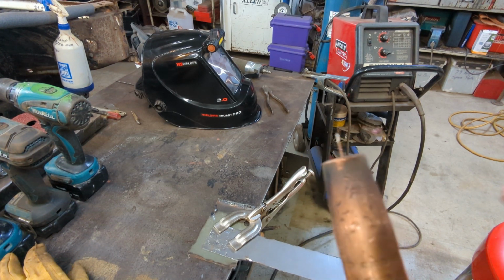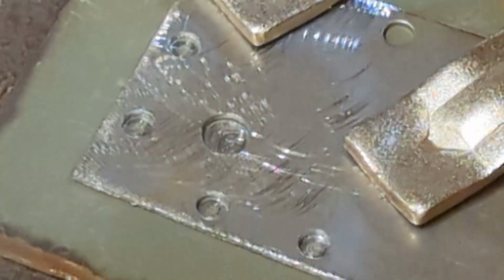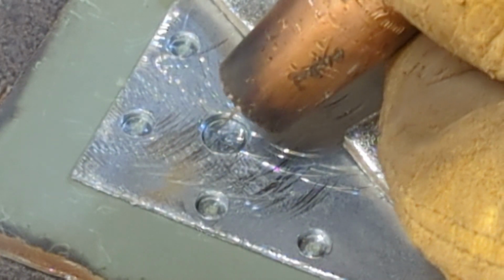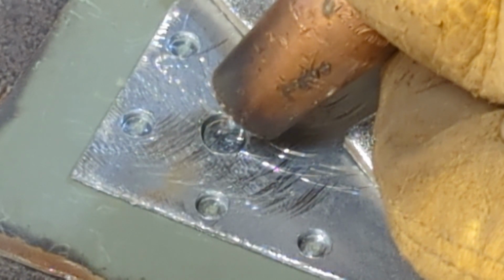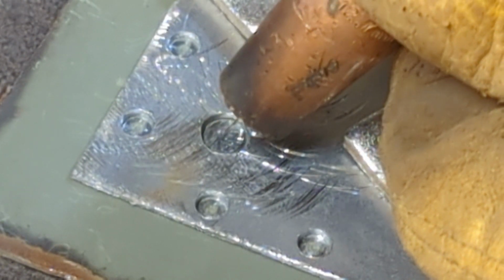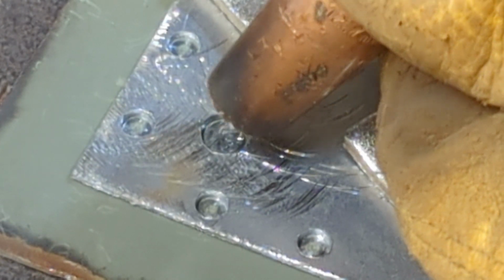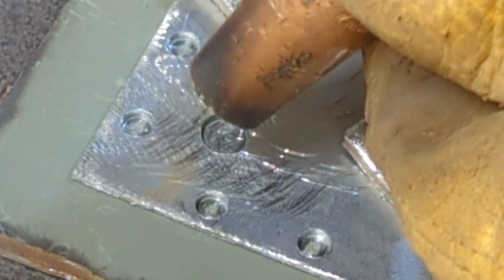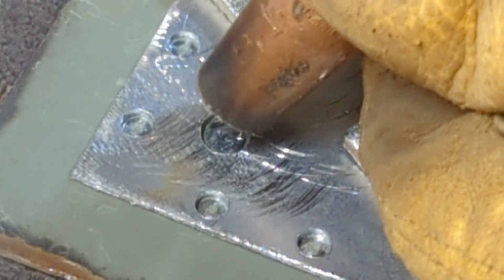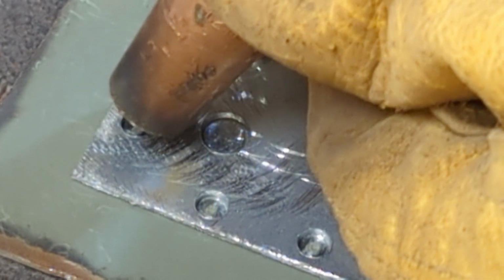All right, so we have that much wire sticking out, and let me zoom in and I'll show you how I start welding it. Now I got you zoomed in pretty good, and I have my welding glasses on at a distance. It's hard to tell what's going on, but I can see through the camera. So this is kind of what I do. I try to get the edge here. Now I used to go in here like this and do it, but I found I had a lot of welds that you couldn't say they were good, and I would go around and build it up. And it's okay if you have a clear place to work, but I found that sometimes you're in a tight spot and you're not really getting in deep and getting a nice hot puddle in there. So what I do is I hit it there basically like a stitch weld, and I just go around. And then you can do the same with the smaller holes. That's why I like the bigger holes. It gives you a little more room to work, but it can still be done.